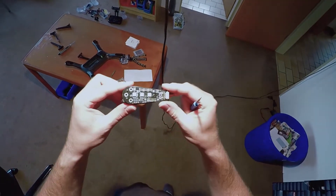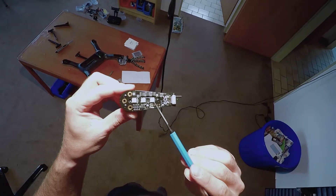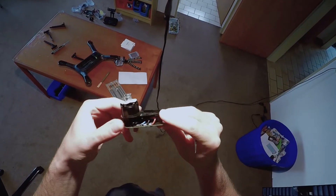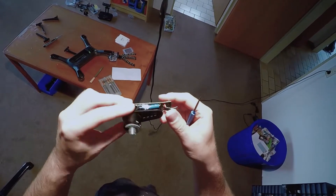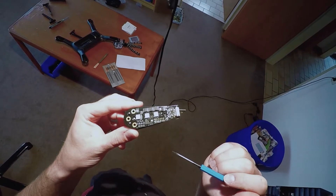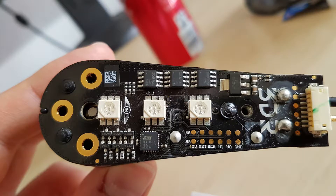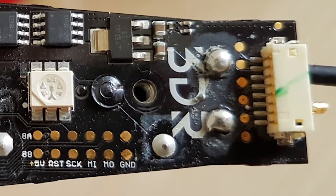Since we are already inside, we might as well have a quick look at the electronics. In every motor pod there are three RGB LEDs and driving transistors, a fully discrete brushless motor driver consisting of six MOSFETs, and peculiarly, two large Atmel microcontrollers. Surely one would be enough for motor driving, LED driving, and mainboard communication, don't you think? The manual soldering on these is horrible — thick flux residue and loose solder droplets.